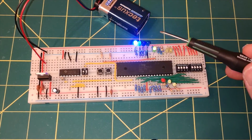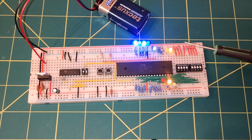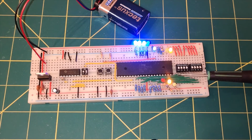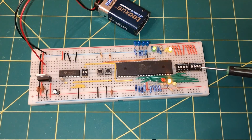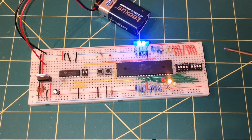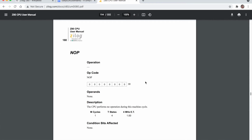And what is happening is it's doing what we call a fetch, decode, execute cycle. So it will fetch from memory. So the memory line will go low and the read line will go low, and it will fetch from memory and it will get whatever's on these pins. Now I've deliberately switched them all to the off position. They're all down. Now if we look at the manual, which tells us all the instructions, on page 180, and I'll leave a link in the description to the manual, is what we call the NOP code. Now that stands for no operation. Basically it means do nothing, but even doing nothing actually takes time, and once we look into this a little bit more, you realise there's actually quite a bit going on even when it's allegedly doing nothing.